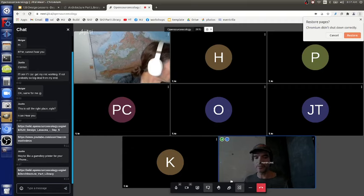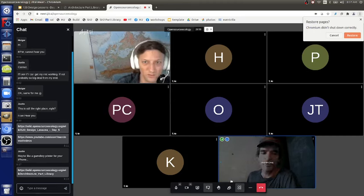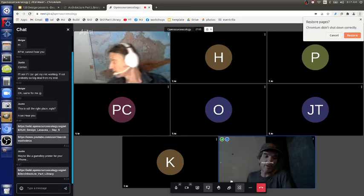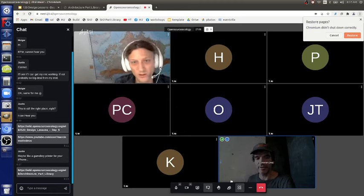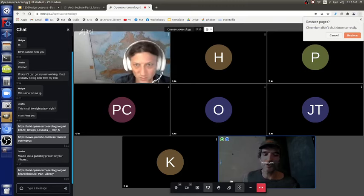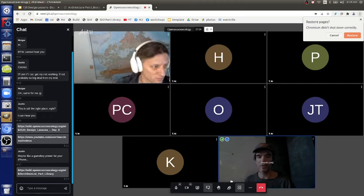So there's the spatial orientation that you have to pay attention to, and once a whole team gets very familiar with that, people can do the CAD much more readily and then integrate it at the end more rapidly. But you can also just say, I'm just going to work in the XY plane, so that's the first thing that comes up in FreeCAD. You don't want to get confused, so you start working in the XY plane. Well, if you work with that, you'll have extrusions in a Z direction, so that will determine the kind of geometries you can build.